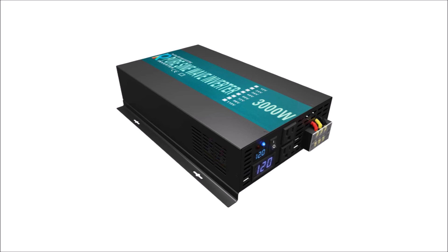In conclusion, I think this inverter is a good value. At just under $400 US dollars as of the time of this video, it's hard to beat the price for a similar size inverter. I was unimpressed with the 5 gauge wires that came with it — they won't come close to handling 100 amps continuously, let alone 300 amps. And I would have liked to see some sort of protective covering over the power block and the terminals. But all in all, I think this is a good product that appears to live up to its rated specs.